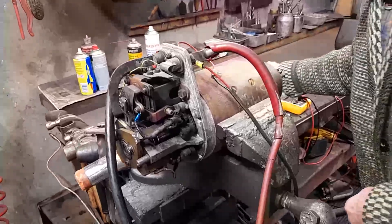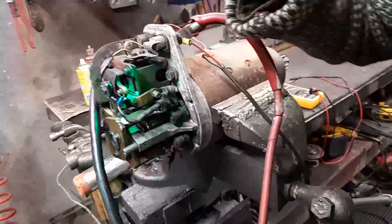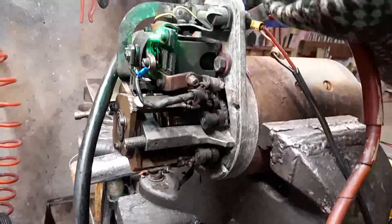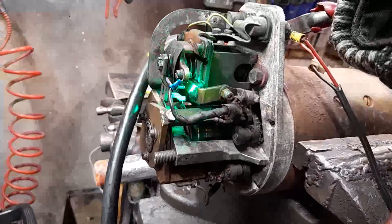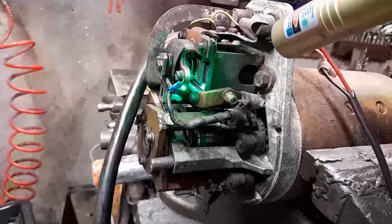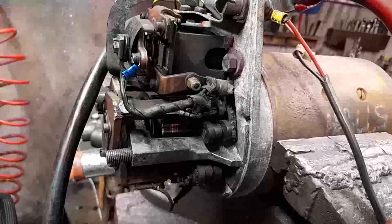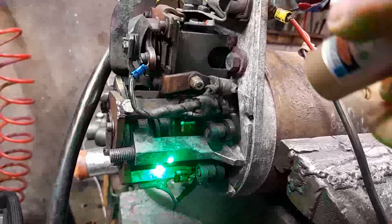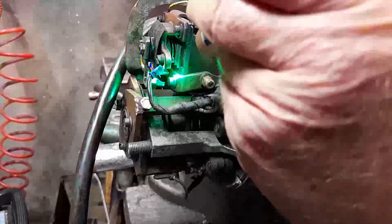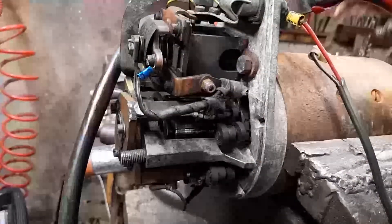What's wrong is the contacts here. I can use my laser pen here. The contact at the top is making contact just there, but the bottom one — you see that chap there where the green light is? — that chap is not coming in close enough. There's a tiny gap down in there. Now, there are a number of reasons for this.